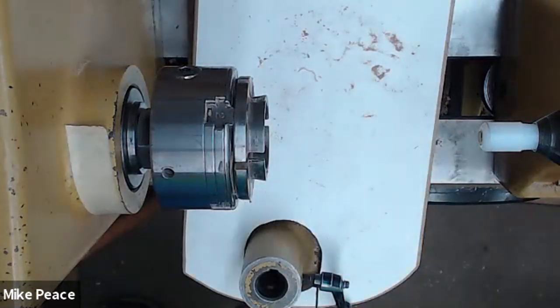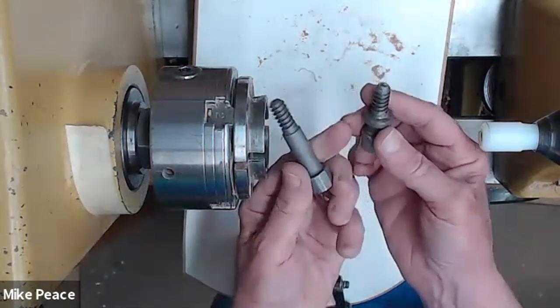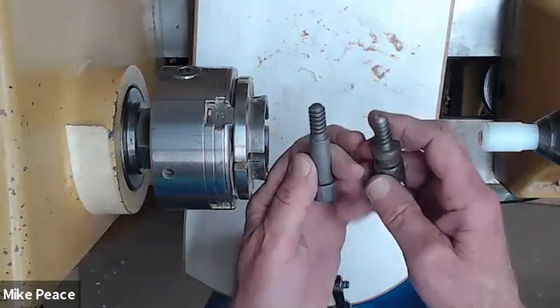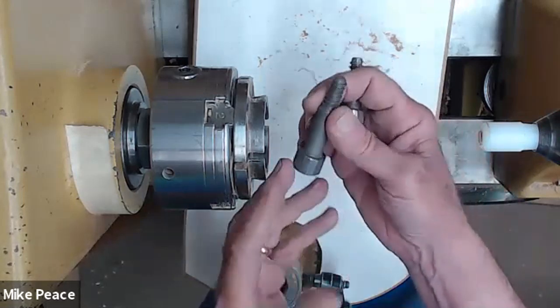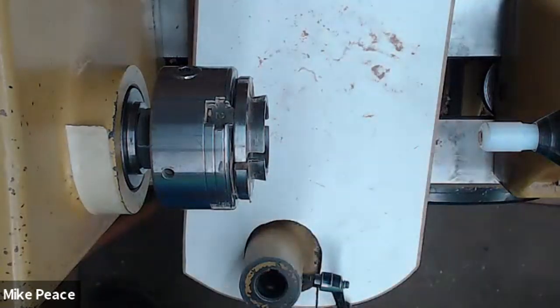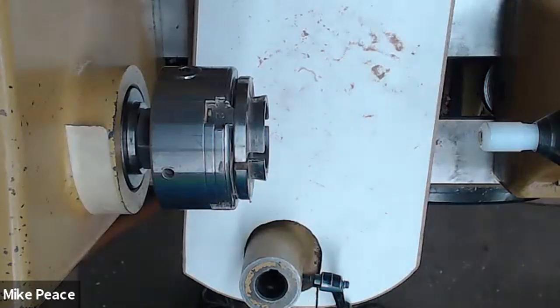The Woodworm screw is just like the screw chuck, except almost every chuck comes with one. In my case, the Titan even comes with one. And it has the same amount extending past the jaws. It's longer because it's got deeper jaws than the normal jaws, but other than that, they're virtually identical. And here's another one of those things where the manufacturers will have different instructions, and sometimes the instructions are just flat goofy.